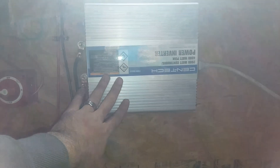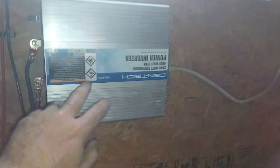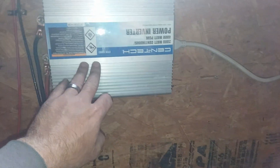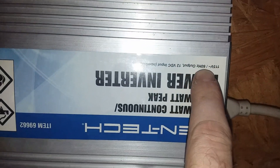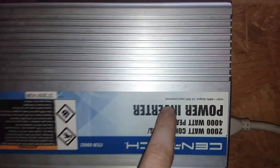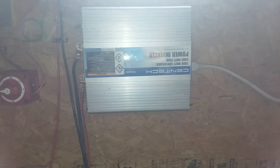This works pretty good, but I notice when you try to plug a household fan into it, it won't power it — it seems like it's lacking power for some reason. Maybe because it's 115 volt output and the fan expects 120 volt. It says 115V 60Hz output. I think it might also be the wave type — it's not a pure sine wave.